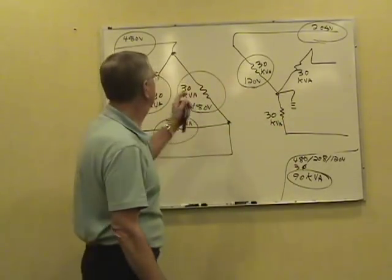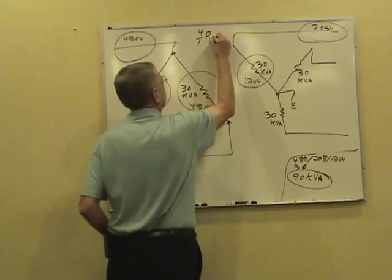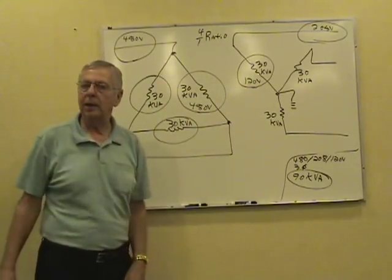And a 480-208-120 gives us another 4-to-1 ratio. 480 divided by 4 is 120. 120 times 4 is 480, like that.